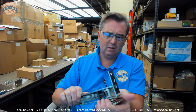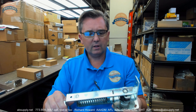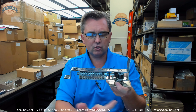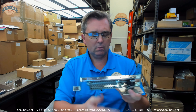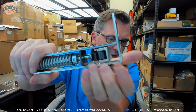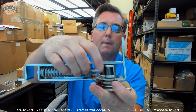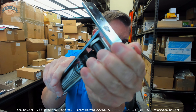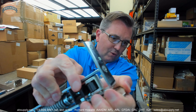First, the business end of this model. Just by looking at it, I can tell you this is going to be a medium duty, adjustable spring tension, non-hold open. I happen to know it's medium duty. We can tell it's adjustable spring tension and non-hold open because when I turn that, there is no bird's mouth preparation on the inside of this lobe. If there was, it would hold open when you brought the door to about 90 degrees. This one does not have that at all — so it is non-hold open.